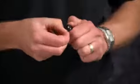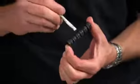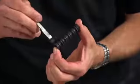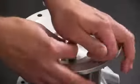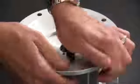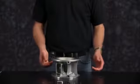Once all O-rings are installed in the O-ring grooves and not blocking any porting, apply grease to the O-rings to ensure they are not catching, binding, or cutting while assembling components. And gently press in the pilot sleeve so we don't roll, nick, or damage any of the O-rings.